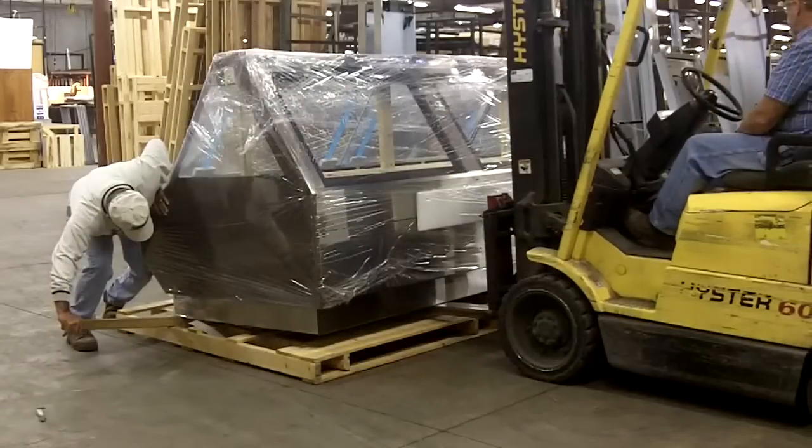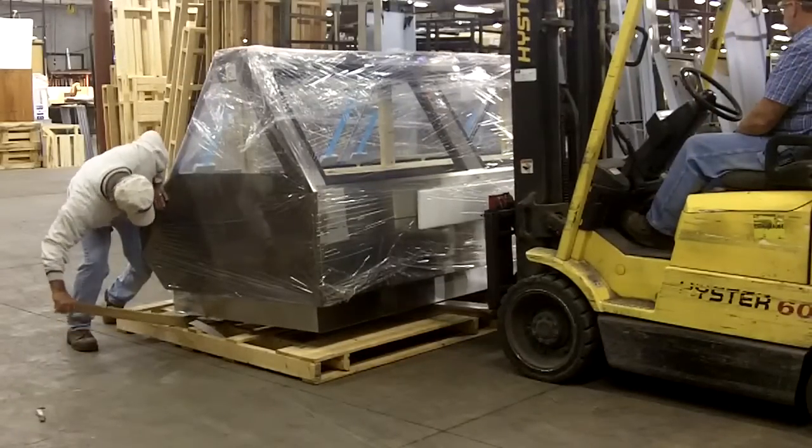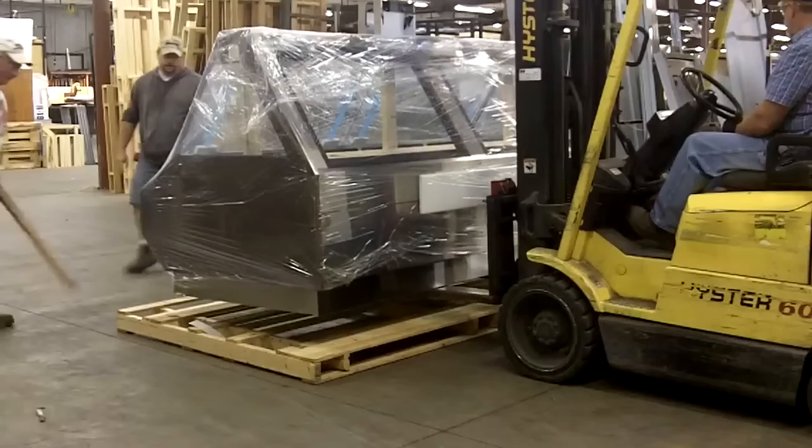To allow the forks to slide under the front kick plate, position the oak bar under the front corners to lift the case high enough for the forks to appear out the front of the case. Slowly lift the case from the pallet with the forklift.